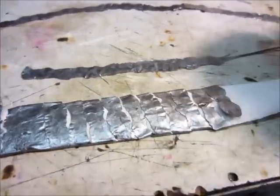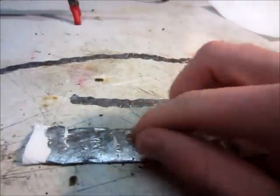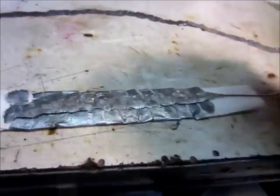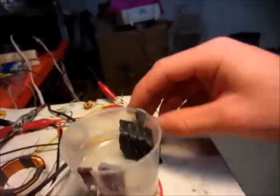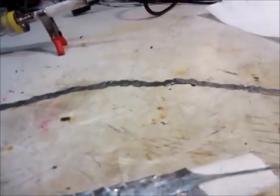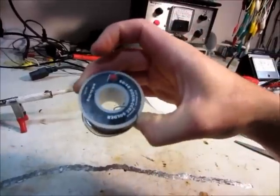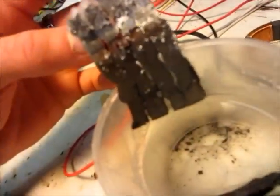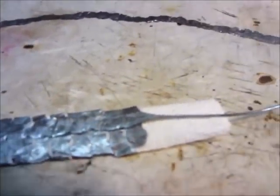I've got it all wrapped around the paper towel now. The next step is to make sure there are a few spots tacked together, just in case it dissolves or corrodes away somewhere. I'm going to tack this piece here - this is going to be one of my terminals - tacking it all the way down with just the soldering iron, melting little spots on each layer to tack it together. That's actually how I made the plates on the existing battery too, and that seemed to work pretty well. As long as you don't mix different kinds of solder - I'm going to clean off my tip real good before I start tacking so I don't contaminate it.